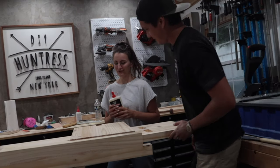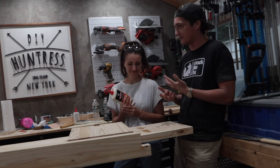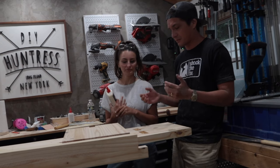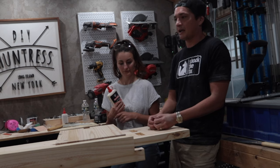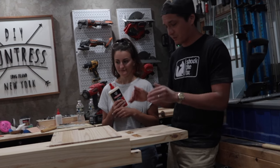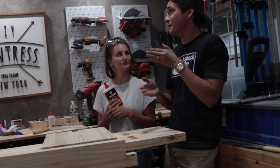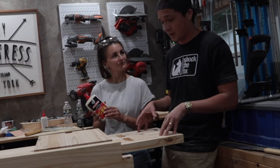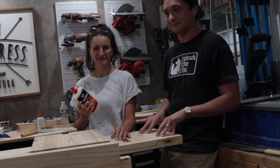Let's talk about how to actually glue this up. A lot of times when I'm gluing up a panel, we're trying to get that squeeze out — that's kind of the whole recommended thing. But I've noticed with mortise and tenon, especially when it's blind like this, what ends up happening is people overfill the mortise with a ton of glue, put their tenon in, and it's just spurting out glue everywhere. It turns into a whole mess. So the idea is that we want to really focus where our glue is and have it more at the bottom of the mortise, forced towards the corners, because you're trying to get that edge grain to edge grain connection, or face grain to edge grain connection. Having glue in those specific locations is going to be more beneficial and stronger.